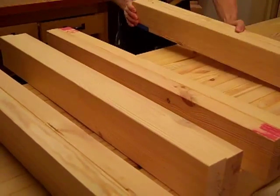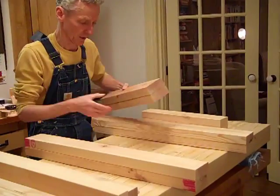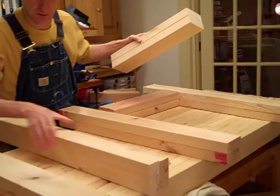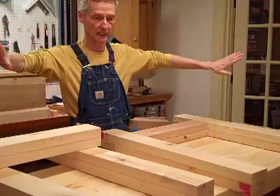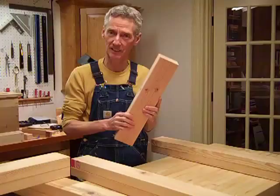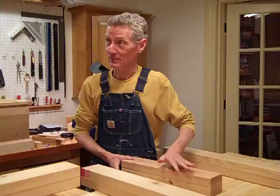Here are the four legs, and there are also four joiners that join the legs into pairs. The legs will go like this, and then this will go between them along the bottoms. So we'll have leg pairs joined by long stretchers that are laminated two-by-eights. These will have big tenons cut at the ends of them. I sure wish I had a second marking gauge, because then I'd be able to mark the tenon width and length with its own dedicated gauge — but I guess I'll do the best I can.